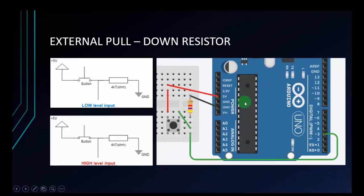This case is the reverse of pull-up. In the pull-down resistor diagram: 5 volts connects to the button, the other pin of the button connects to the resistor, and at the same time connects to the input pin. The other pin of the resistor connects to GND. I won't make an example with pull-down because it's quite the same as pull-up — you can try it yourself to see the difference.